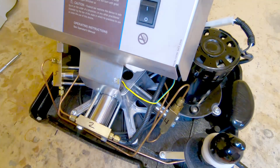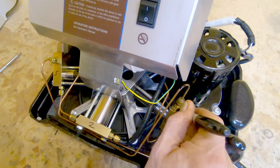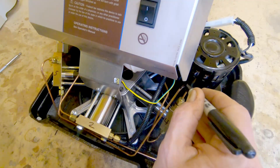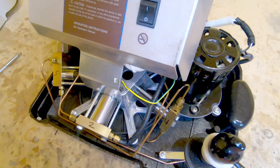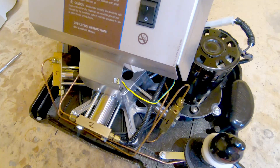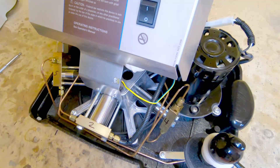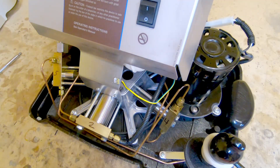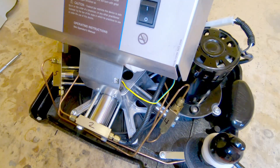So it's a really, really good idea to make a mark of some sort to indicate which fitting goes where. In order to disassemble this, it's going to be necessary to remove these fittings. These are high pressure compression type brass to copper fittings, and it's pretty easy to damage these compression nuts if you use the wrong tool. So don't just go get a pair of pliers — get the proper tool.